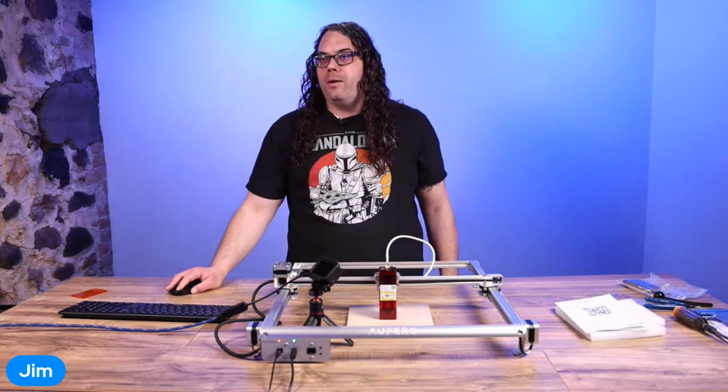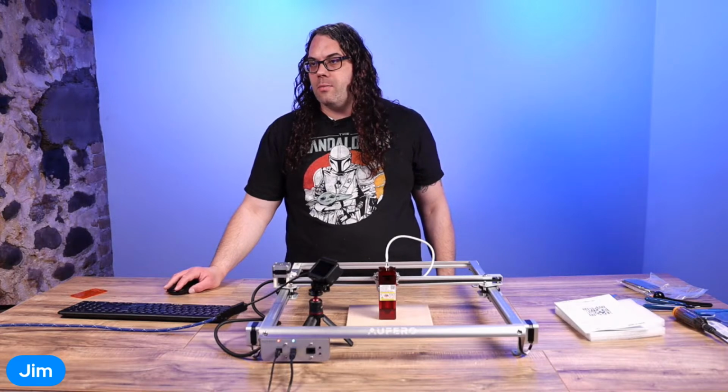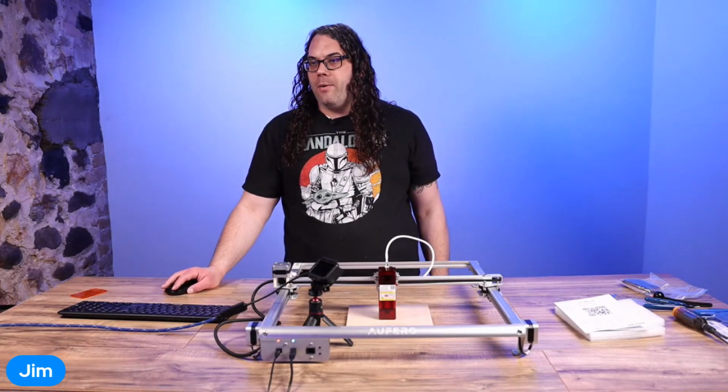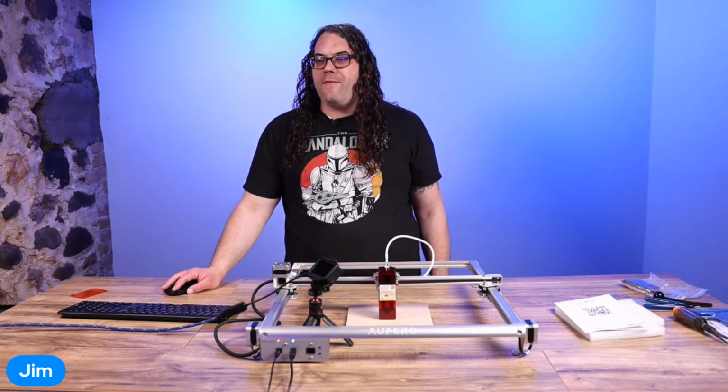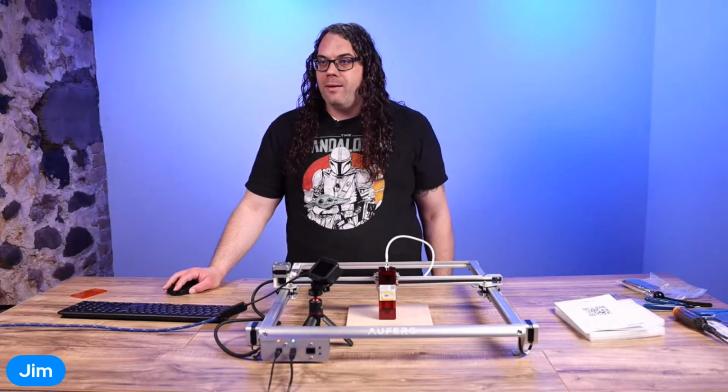Okay. So I have it set right now at 10,000 millimeters a minute at 95% because why not? I have not done any testing. We haven't checked it out. Well, let's pop this preview. Let me just see how long this is going to be. Wow. I was going to put some music on, but 17 seconds, according to this.